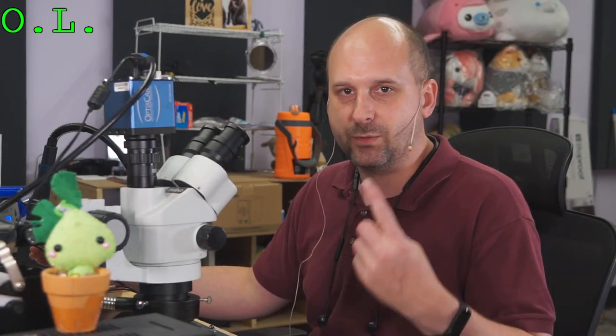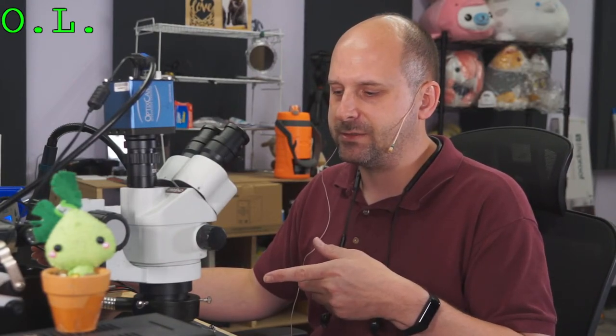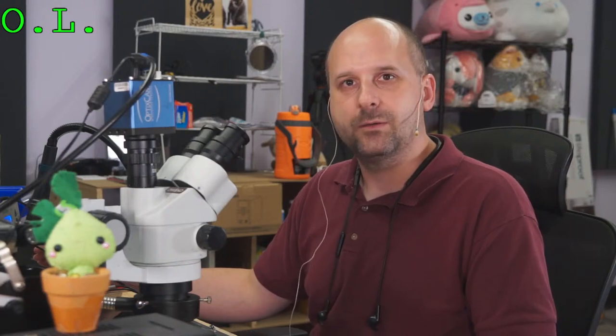Most of the time, the backlight driver is dead too. I think there's only one time so far that the backlight driver was not dead. This may have not been dead because the screen was dead. So that backlight driver I took off, that might still be good, since it's tested good too. I should probably keep that then. But I hope you learned something. Happy hunting.